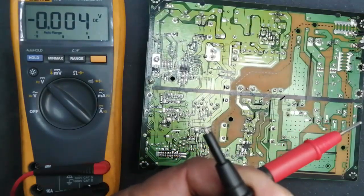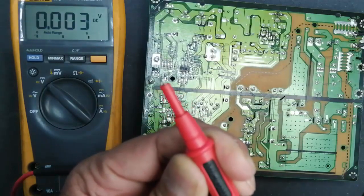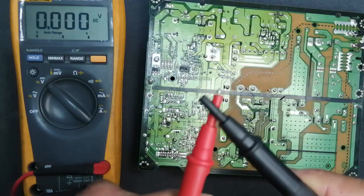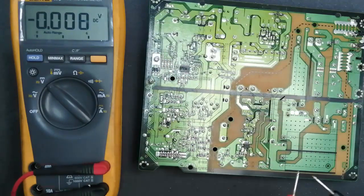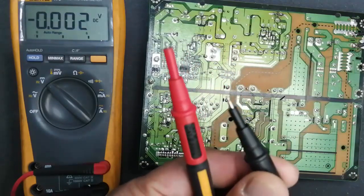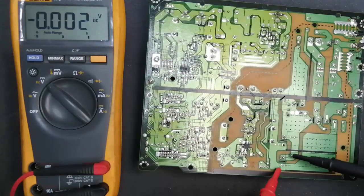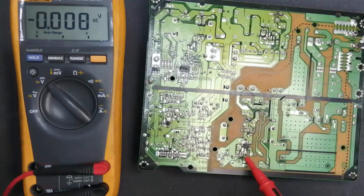If we don't have 300-plus volts here, we have to go back to the circuit. There is another safety concern when testing on the board with closed pins — the multimeter probes may make a short circuit. If your multimeter does not have insulated probes, you can install insulation sleeves or heat shrink sleeves so you will not make a short circuit. Here I have DC voltage.